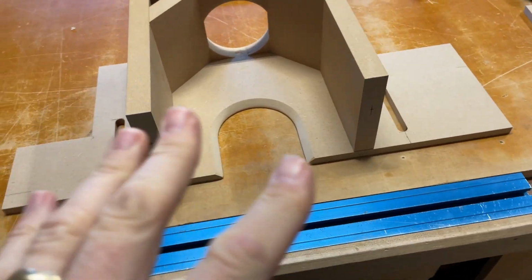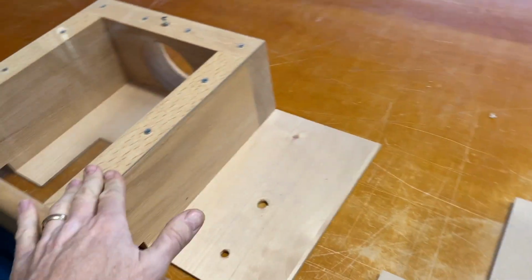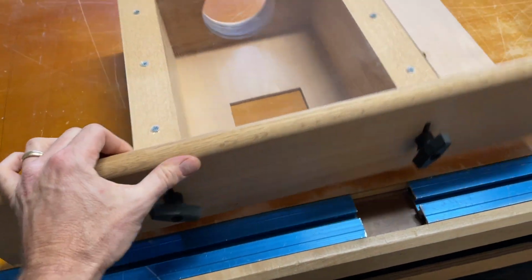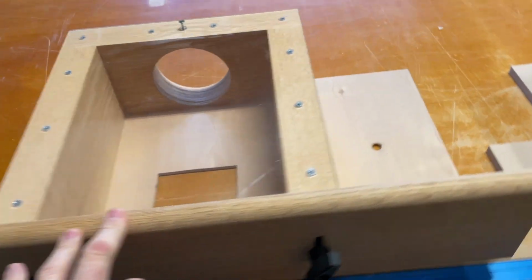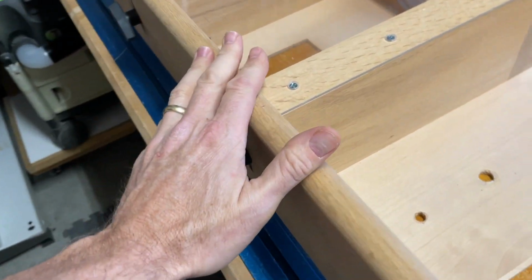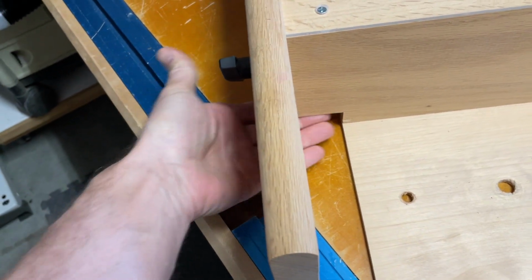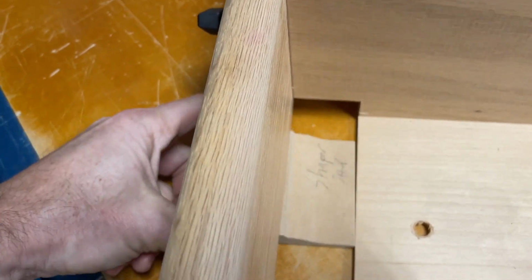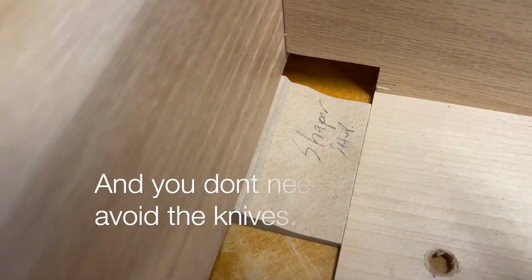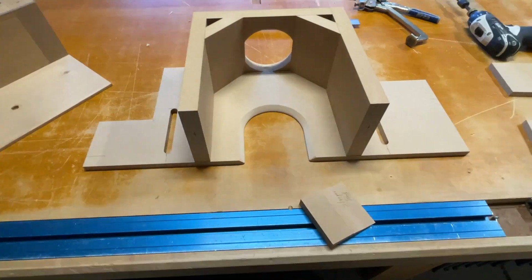almost complete. Now, as I was doing this, I realized that my raised panel fence, this is the one that I have in my raised panel shaper, works absolutely perfect. And the way that I inset this part here extends the hold down out, which is great for when you have your raised panels, because when you put it in, it's further away on it. You see what happens? It puts pressure on the flat part and not on the void. So that's what's nice about this being set back, or I should say, inset, however you want to look at it.